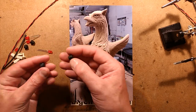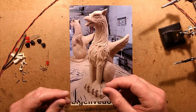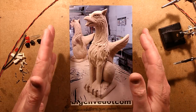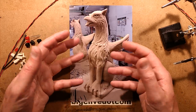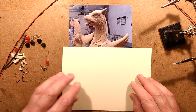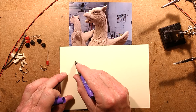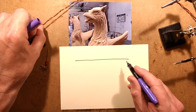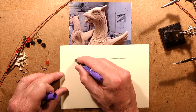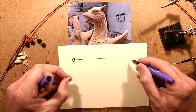I use these a lot because in prop making it's much easier to send a pre-made wiring loom that just gets built in, rather than spending time on set trying to build electronics into finished props. So here's the plan: two 1-metre tails of twisted wire, with the LED and grommet at one end and one of these little connectors at the other end.